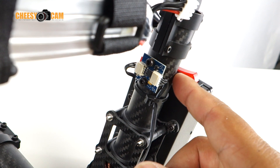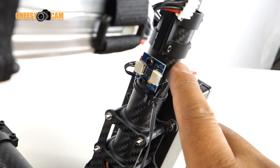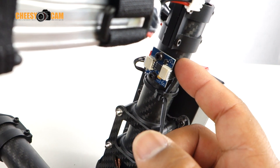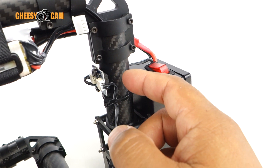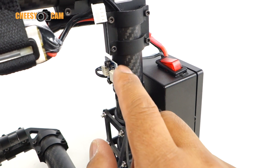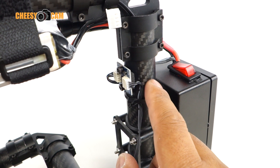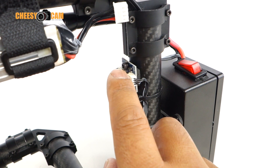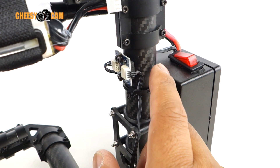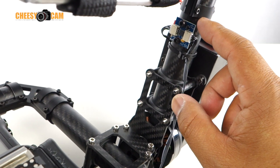If I did it the other way, I would never be able to tap into this curved pipe. By doing it one on top of the other, I was able to mount it directly to the frame. So if you're planning on upgrading your gimbal's frame IMU, you could do the same — just one on top of the other. I added a little bit of neoprene to give some spring tension, then tightened it over the neoprene. That holds it in place pretty square. I drilled small holes into the tube, just big enough for the bolts, and forced them in so they hold very well.